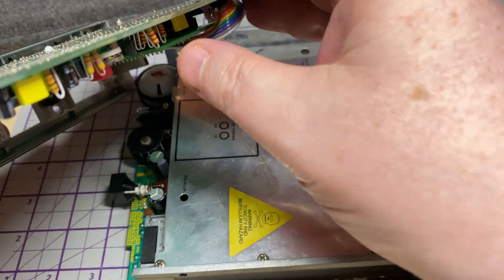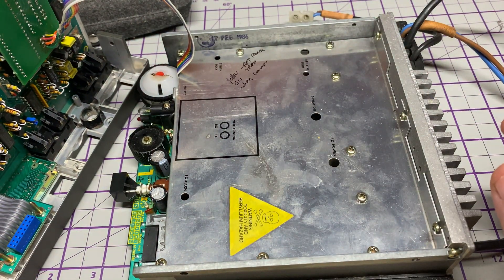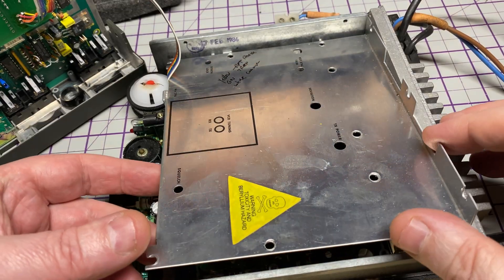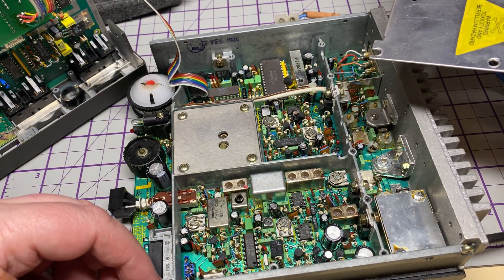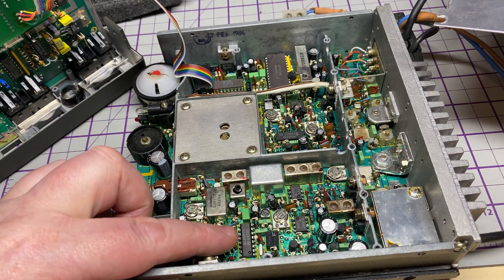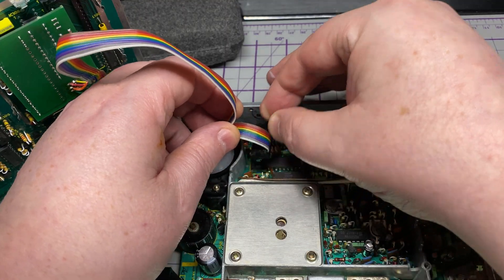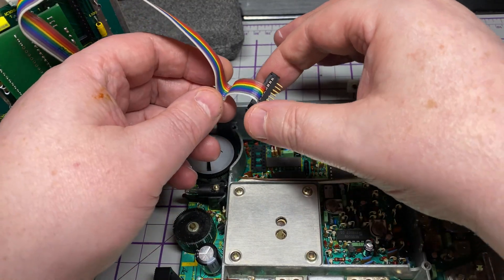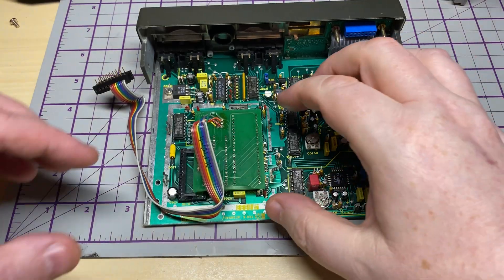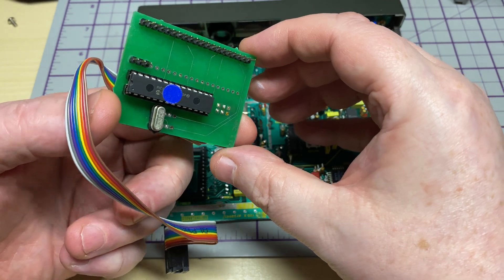These modules were just originally plug-in on the front, really easy to change. But you can see this one's had a modification done to it by a radio amateur — dated 1986 — and what this does is it turns it into a part UHF amateur radio for the 70 centimetres band. It's PLL controlled, even an MC3357 in there. Normally these have a PROM — programmable read-only memory, one-time unit — but this radio amateur has made a modification that plugs into the PROM socket and replaces the main processor on the TEDX with a PIC chip.